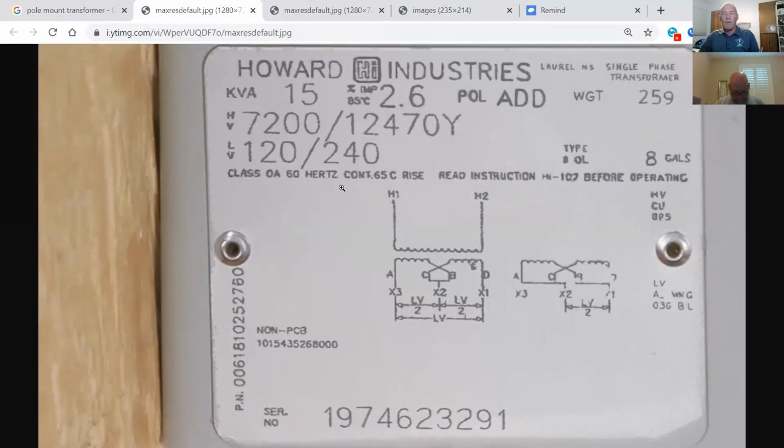No. Robbie, this is Scott. I need a 15 kVA transformer. What's your reply going to be, Robbie? What's your secondary voltage? Right, and your primary voltage. What's your primary and secondary voltage? All right. Ask those questions while you're out there in the field and don't get stuck with somebody giving you misinformation or no information at all.